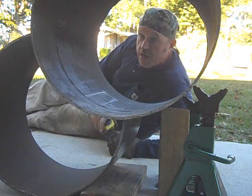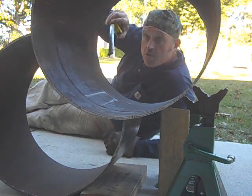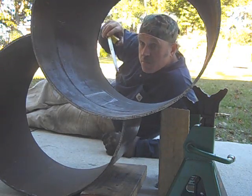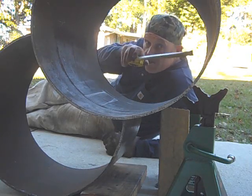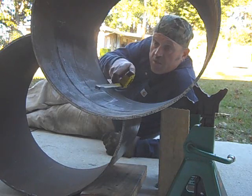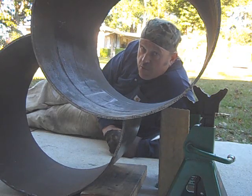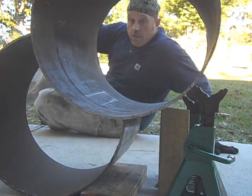Okay Warren, here's the thinking on this — here's how it's going to be sitting in the little hole. We're going to cut the heat entry hole right here from the firebox which is over here. We're going to elevate it a little bit so it's not on the bottom. Your grease is going to fall down, some will fall into here. Cleanout is going to be really easy, just push everything down into here and clean out from the firebox. We'll put a little deflector shield so when the heat comes out, it's going to bounce over here, run to the top, hockey stick up, and go right in through all the meat. That's what we're thinking — like Papa Louie says, we're breaking new ground on this puppy. I'm going to cut this out, and that's next.